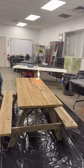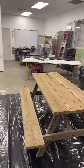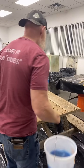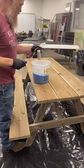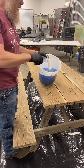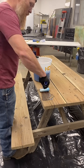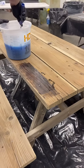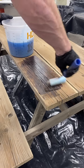Sorry I took so long playing around there. I'm trying to make sure this stays dry. I got my epoxy. I'm going to start out with just a brush and a foam roller. I don't want a ton of excess on here. This is our countertop product — I did thin it with acetone so it would soak into the wood. My goal is not to just pour it out; it's to get as much down as possible and really work it in.